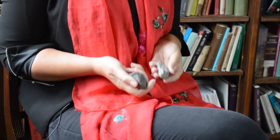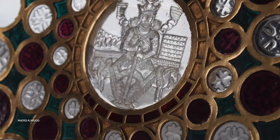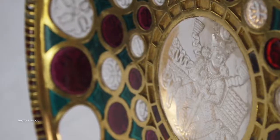These emery pieces or diamonds were crushed into abrasive powders, and all the tools used — most of the time in a soft metal — were used with the abrasive powders. All the details of the decoration were realized using a series of cutting discs or drill bits. For example, on the Cup of Solomon, the little dots that you can see on the sword were done with a rounded drill bit, extremely small, a few millimeters in diameter, and some of the cutting discs could be extremely small as well. The surface of the rock crystal has to be smooth and polished to erase all the manufacturing traces generated by the first operations, but also to regain the natural transparency of rock crystal.